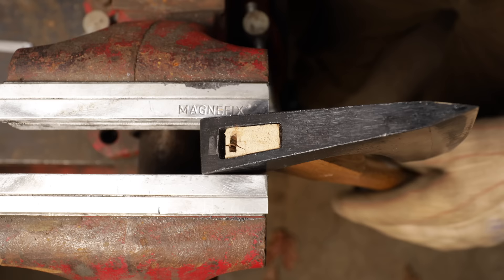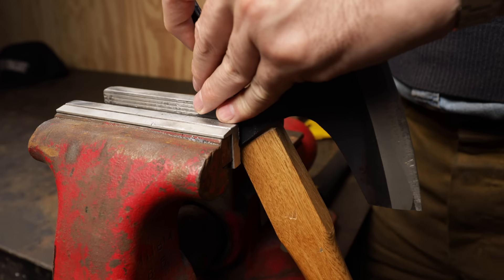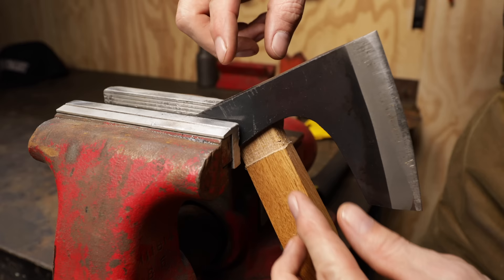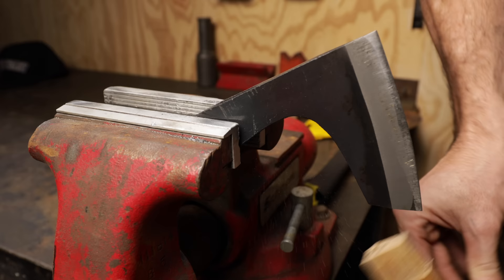So what went wrong here? What is this little wedge supposed to be doing? That's not really a proper wedge — that's a piece of flat bar that someone just cut off with a shear, quick and dirty. Ah, now that's very interesting. There's no taper on the shoulder to keep it fixed at both points. Like in a Western style axe, we've got a taper on there, so the further you drive the handle in, the more it tightens — not only on the top but on the bottom as well. This is just relying upon it to sit, being tightened on the top with nothing supporting it on the bottom.